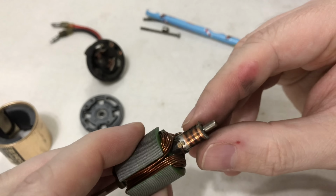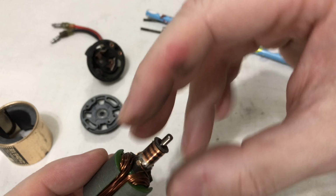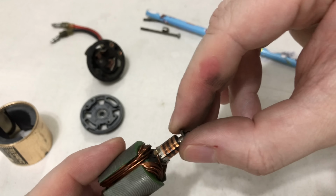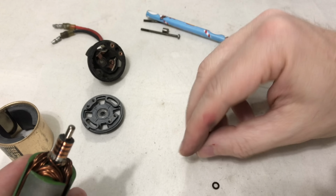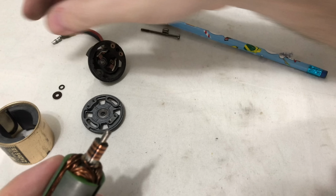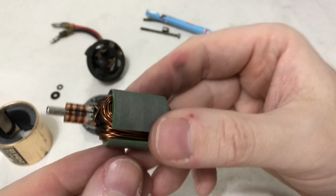take that, I think that's a fiber washer, yeah, don't pull that because they've snapped in the past on me. Just very gently apply the pressure and turn it at the same time until it comes off like that. There was two washers, a little washer on top as well. Very important that they go back together the same way around, guys. But that allows you to get into the top of it and just clean any muck out.